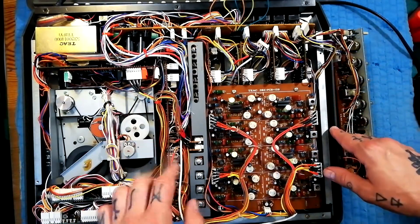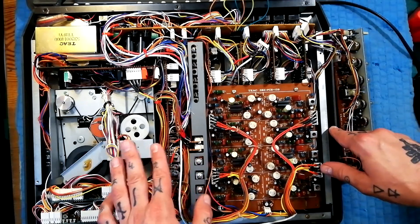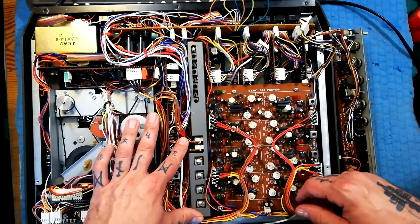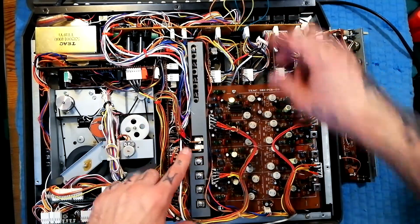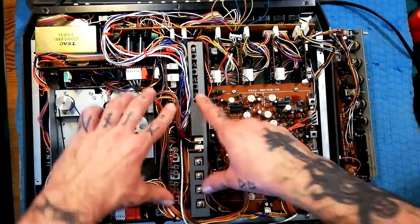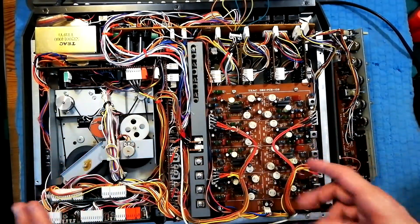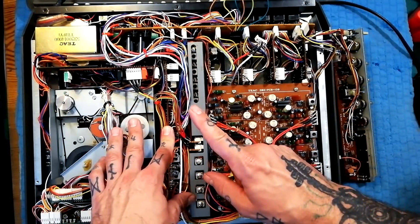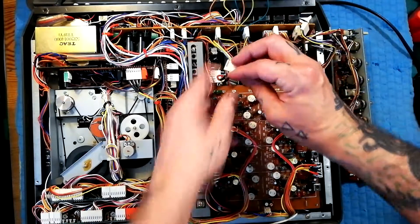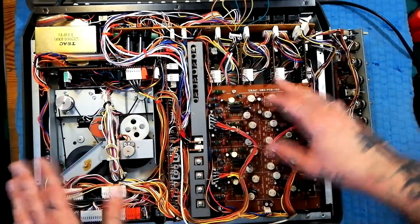I know that the simplest and most obvious problem with the dead right bus is just the master fader on the 244 being dead. The master fader is actually pretty difficult to get out — it's attached by two screws to this plate, but you need to take this whole record playback board out to get it. It's not really attached to anything electrically except this plug goes into this socket here. Pretty easy to hoik out.